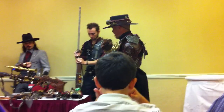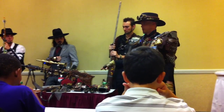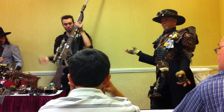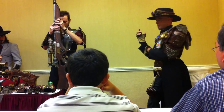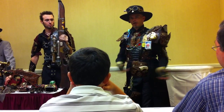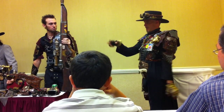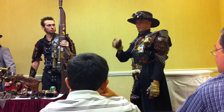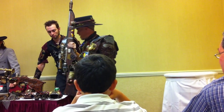One of the things we have found on our weapons is if you're going to custom do your stocks, instead of using yellow pine, even though it's cheap. People got it all over the place. You can go by any place that's building houses and grab it out of their junk bins. The only problem is it's a really soft wood. So if you're loading it and offloading it out of your vehicles, going to conventions, if you've got fine scale work cut into it, it will break easily. And it also dings and dents really easily.